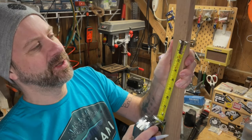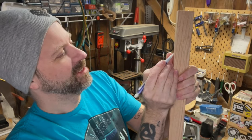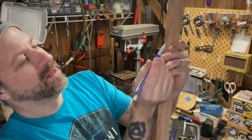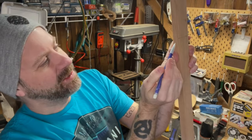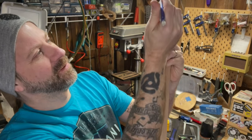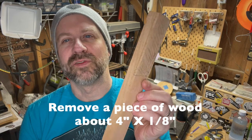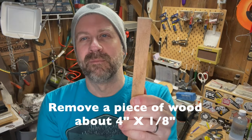Make a mark at about four inches — four and a quarter won't hurt anything — and then take your T-square and square that mark off. For what we're going to do here is come around the side and continue that mark all the way across around both sides. We want to basically notch out this whole piece, but we want that to be even. So I'm going to measure about an eighth inch on both sides and then draw a straight line. I've marked here and around the sides — the scribbled area shows the part that we're going to remove.